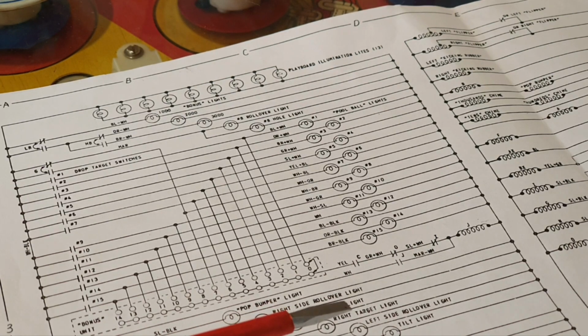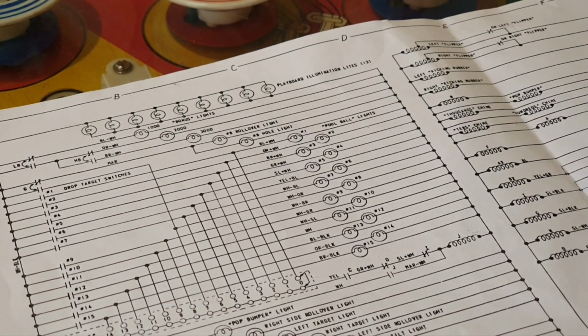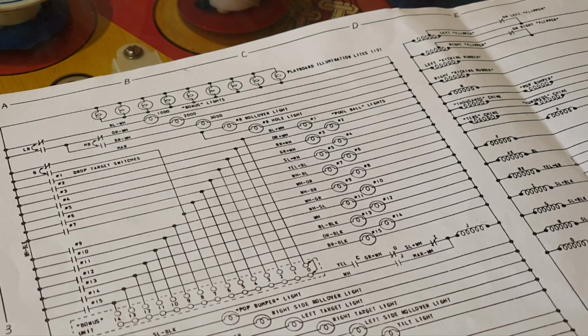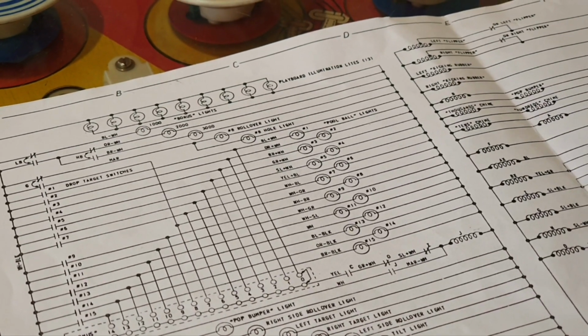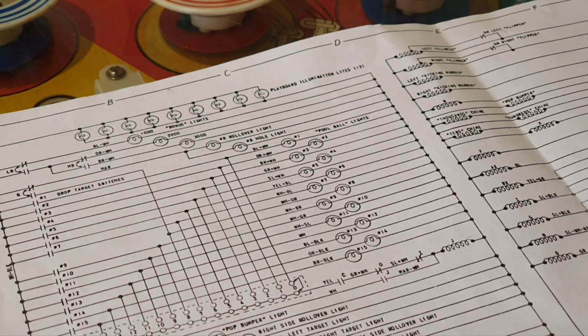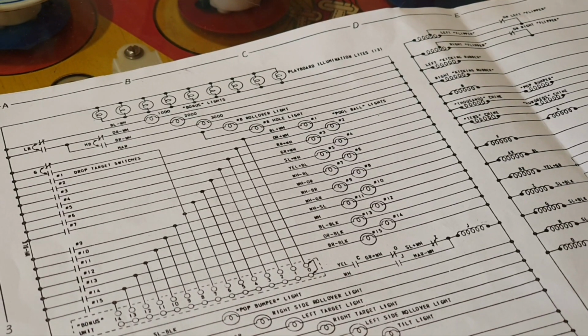So what we then found was that there's a switch in the circuit on MotorStack 3C. Now this switch 3C stays closed till almost right to the end of the cam cycle, and it's like the hold-on switch for the I relay. Now when we first looked at this, the I relay was extremely erratic in its movement. It'd really act strangely. You can normally watch a relay and say, oh, that relay is working well.